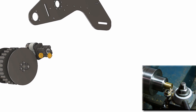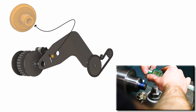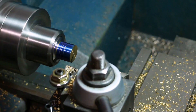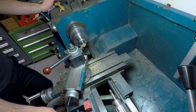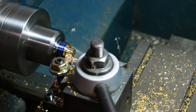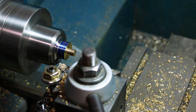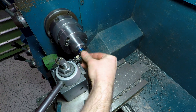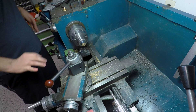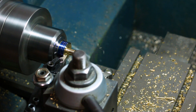Next up, turning down some brass in the manual lathe to make some small parts for the chain drive tensioner. No real critical dimensions here other than this boss that receives the idler sprocket. This part has a large clearance chamfer on it — not super critical so I just used the side of a VNMG insert to get in the ballpark of that angle.